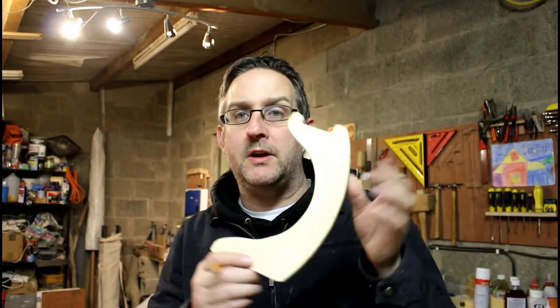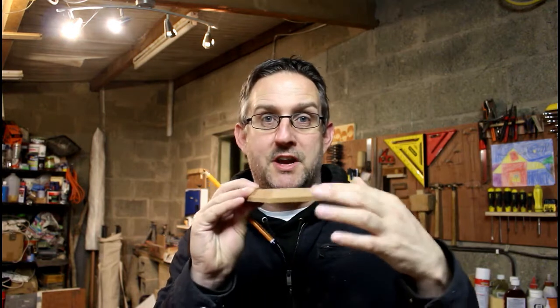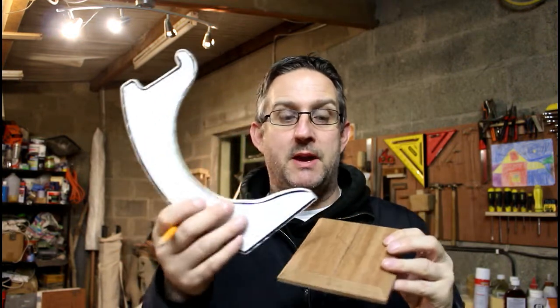Round over on the upright stand on both edges, so that gives it a nice finish on there. And for the base, we've given it a 45 degree chamfer, which is a nice profile. And before we sand, what we're going to do now is attach the base to the top